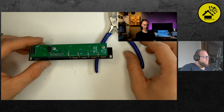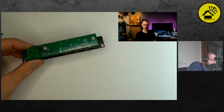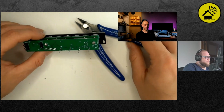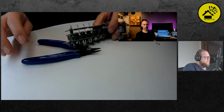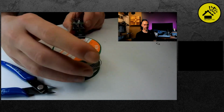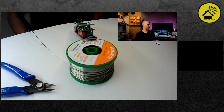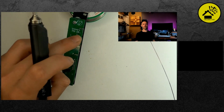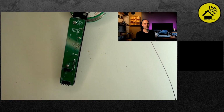You have to find a possibility to place the PCB stack somehow that it doesn't fall to the side. This is tricky now, huh? Yeah. Hey, maybe you can use the roll of solder to lean it against. Yeah, somehow like this. And then you have to make sure the LEDs really go through the panel all the way through, because nothing looks worse than when one LED doesn't look through the panel properly and the others do. Or on the same place like the other, yeah.